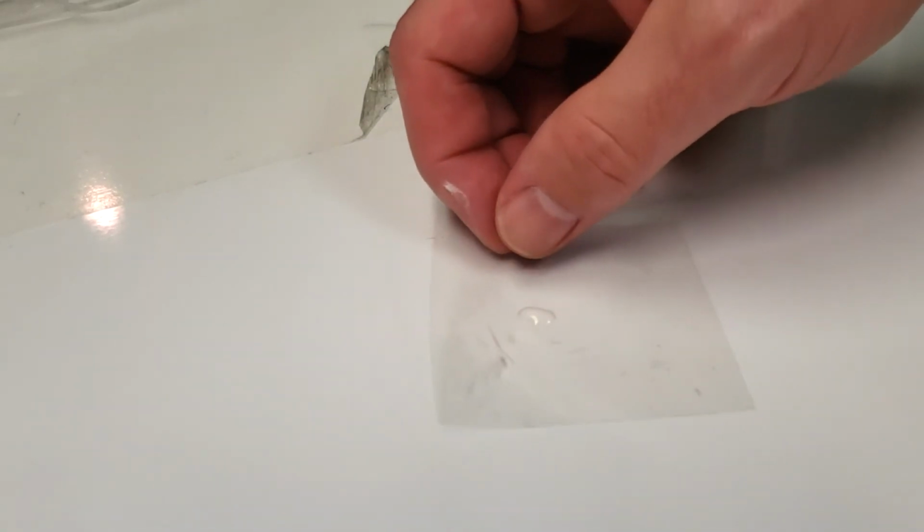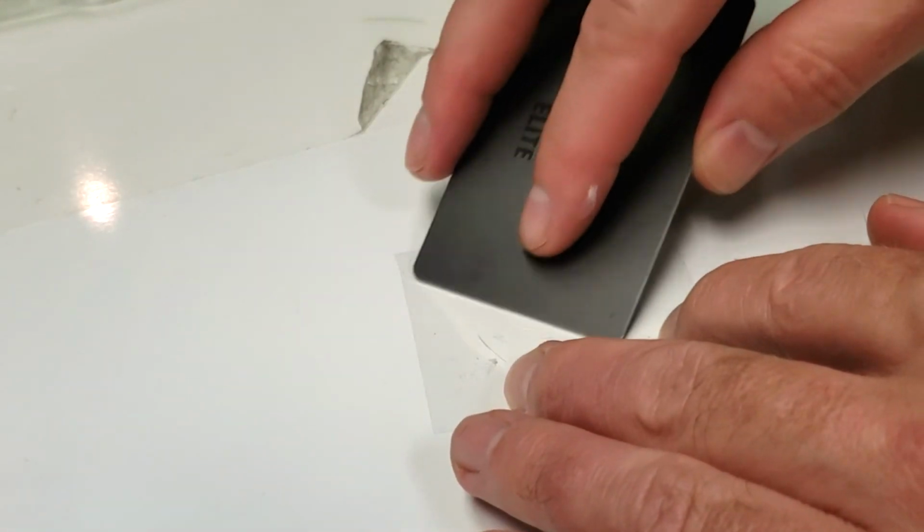Here we found an imperfection on our surface. Apply a small amount of bright white UV Marine Putty onto the imperfection. Use a sheet of UV 881 UV spreading film to flatten the putty and to spread it evenly across the imperfection.